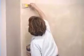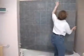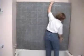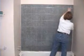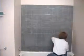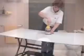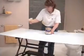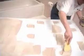Barker panels can be glued to any solid flat surface including cement, cement block, and even ceramic tile. Cement and cement blocks are porous, making it necessary to apply adhesive onto both. You will need to double your adhesive requirements for these types of surfaces. Approximately every 5 minutes, apply hand pressure until the panels are sticking everywhere. Trowel the adhesive.